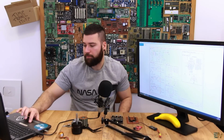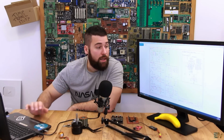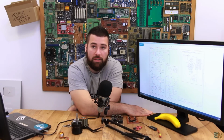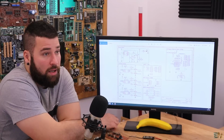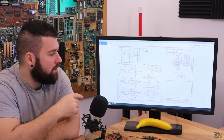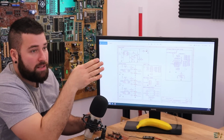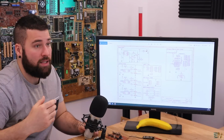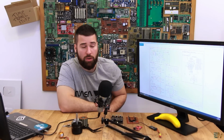And finally, to increase the power of this entire schematic, what you could do is to increase the power of the MOSFETs. So instead of maybe a MOSFET with a current limit of 50 amps, you could add MOSFETs with a current limit of 200 amps. Or instead of placing just one MOSFET, maybe place 2 or 3 MOSFETs in parallel and control the gate of those MOSFETs at the same time.